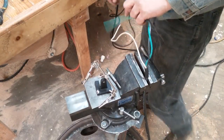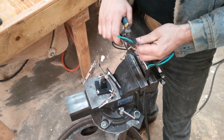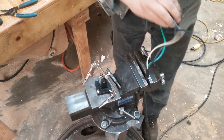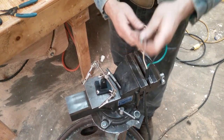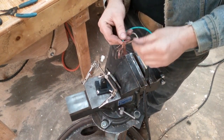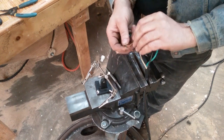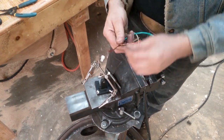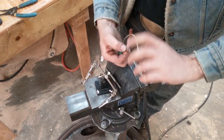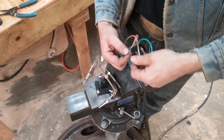Hey guys, welcome back to the shop. Today we're going to do a little quick project. This is how I make eyelets for electrical things. This particular thing is for 12 volts DC — it works an electric over hydraulic setup on a bale spike, and this thing has electrical issues. It was not getting sufficient voltage back to the control solenoid to actually engage the solenoid that reversed the fluid flow through the valving system.